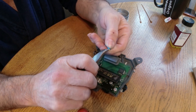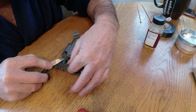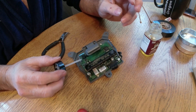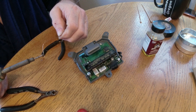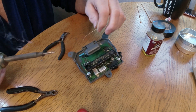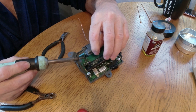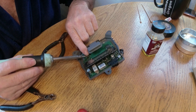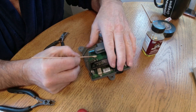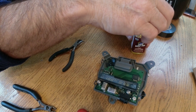Here I'm pre-bending my resistor leads so that they'll actually fit onto the circuit board. Temporarily tape them into place. Add a little bit of soldering flux. Add a little bit of solder onto the soldering iron to help heat distribute through it. Place your solder on top of your resistor lead, then use the soldering iron to melt it into place. Do this for both sides of your resistor. Once again, use 99% isopropyl alcohol to clean all residual flux off the circuit board.